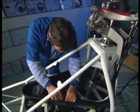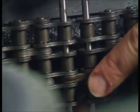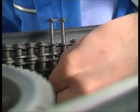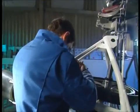Next, the chain goes back on. I've linked the chain together from the top with an old connector link, but you can now see why this little access hatch is in the bottom here — because the actual pin has got to come up from the bottom. Then, as it comes out, you put in some little spacers in the chain. Last little link over the top, and then this clip, which will eventually be painted white so you can see it more easily. There we go — one chain sorted.